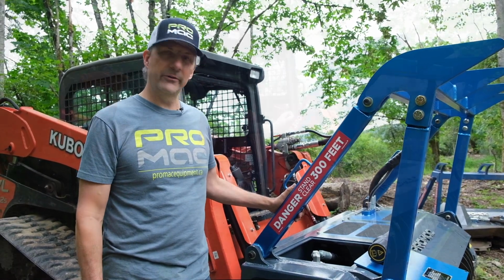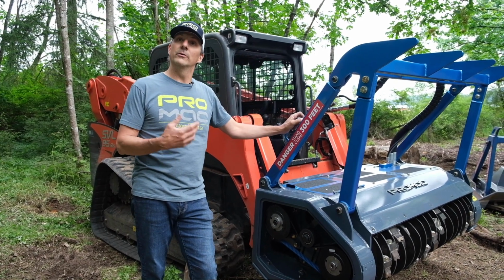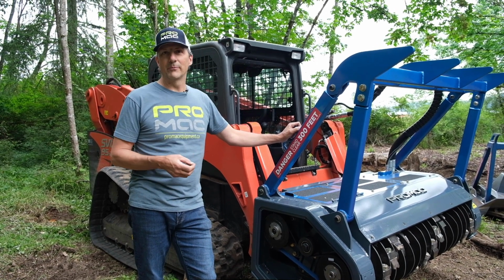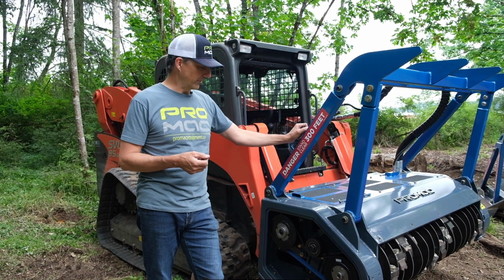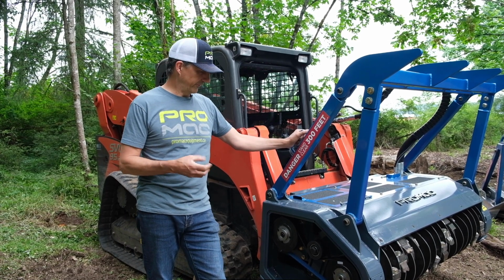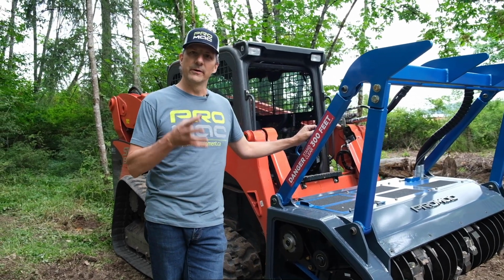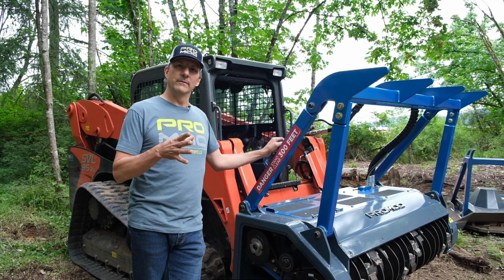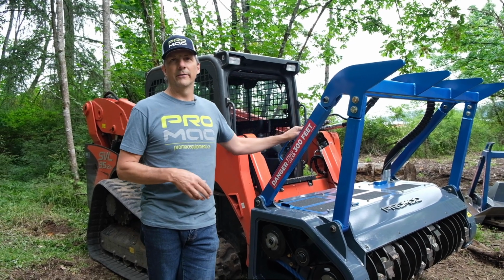At Promac, we're very proud of the fact that we do all of our own manufacturing, including all of our own frame construction and machining of the frames and subcomponents, so we can really control the quality of the components. A good example, which you won't see unless you're working on the machine or constructing it, is the end faces of the frame where the bearings and bearing housings are fitted. We fully machine and mill those faces to create a very square setup.